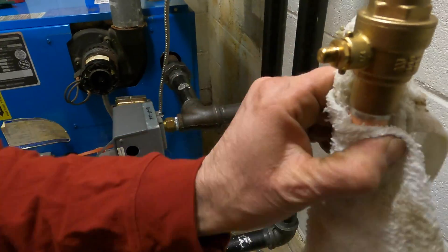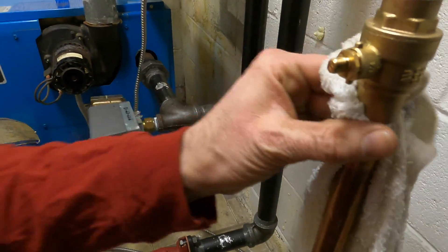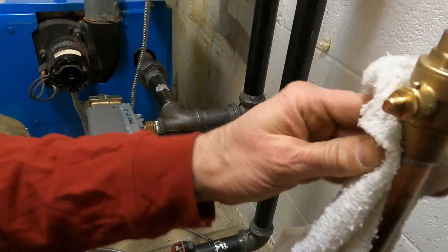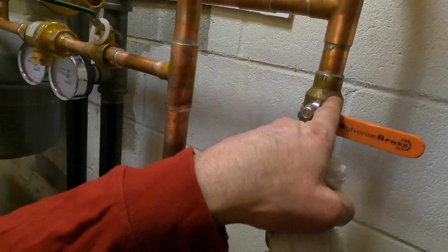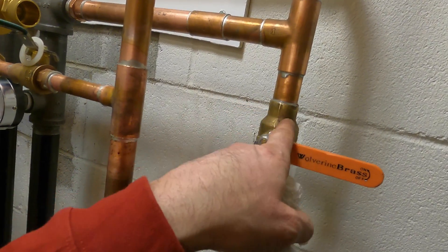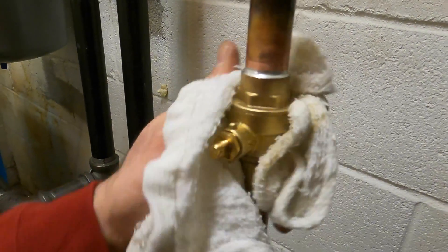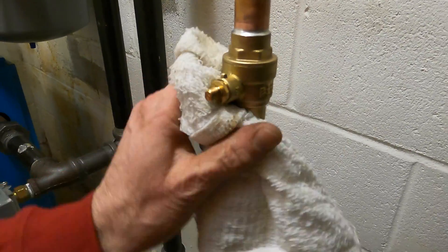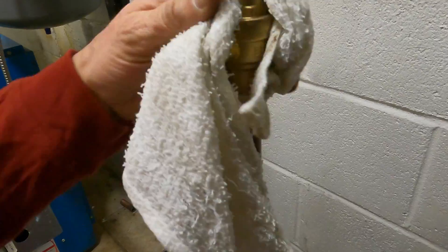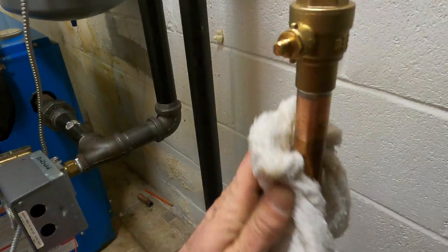Unlike a regular ball valve where you'd throw the heat mostly at the valve, for years I've always heated the pipe first and then the valve, so the change for lead free hasn't been much of a problem. When you're dealing with one-inch pipe it takes a long time to heat up, so heating the pipe then the valve helps. You don't want to destroy the neoprene or nylon seal inside. The problem is that heat doesn't transfer as well through lead-free valves without the lead, so there are factors to consider.